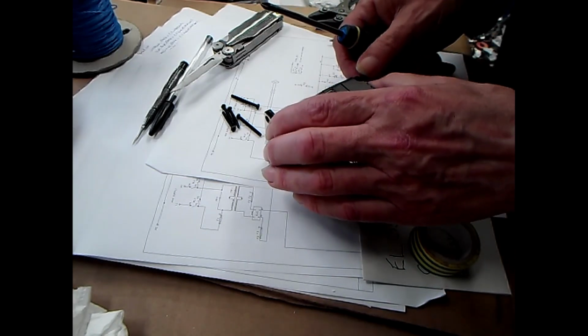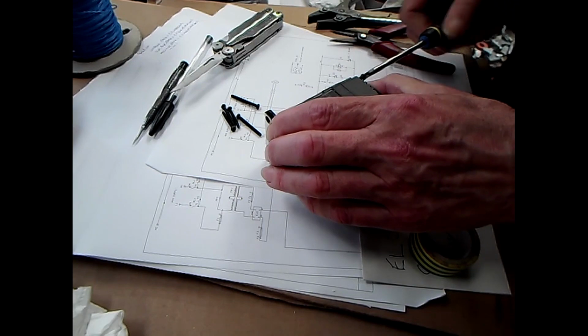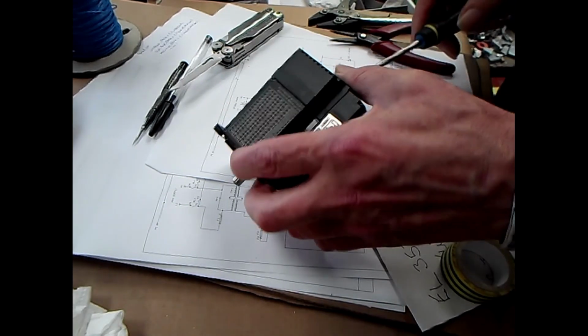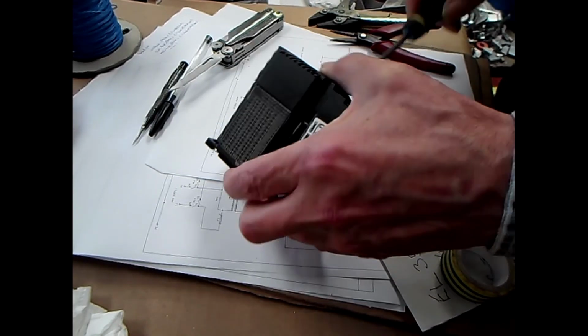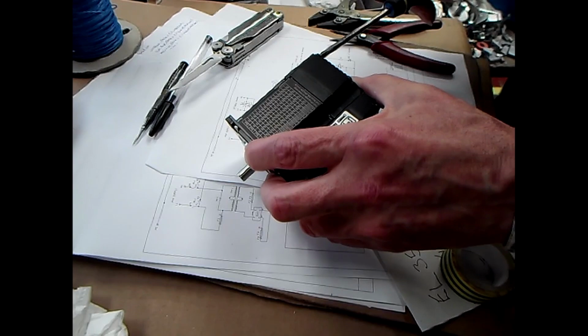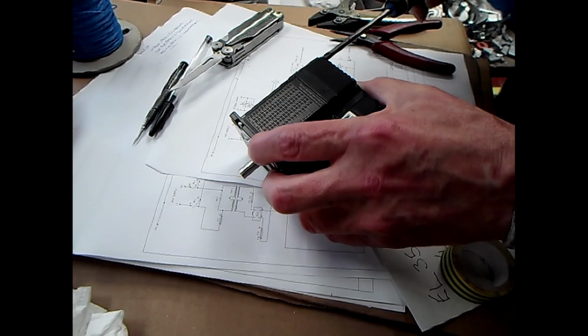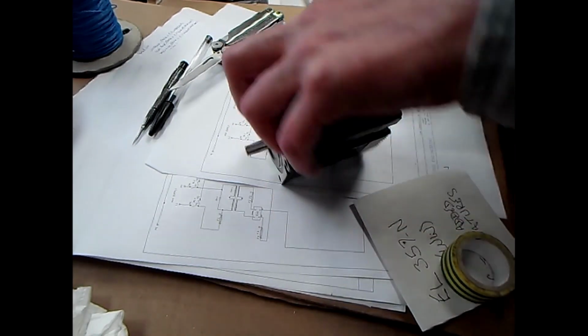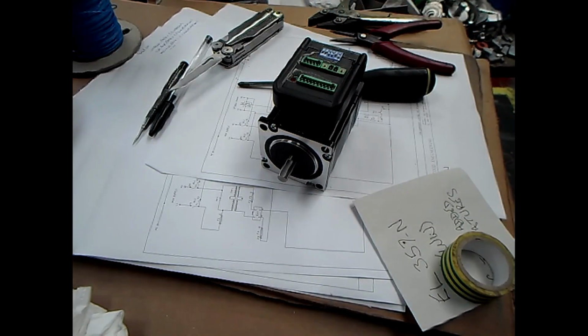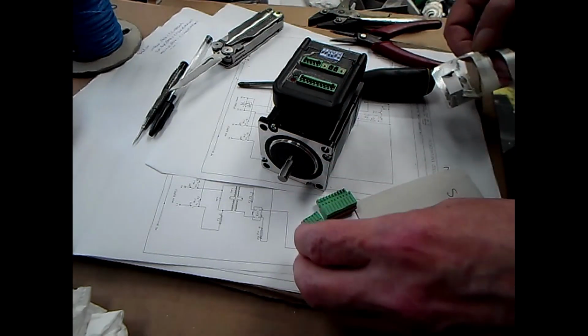If they are intact and the RAM seems okay, the main program can resume. But if the RAM is not okay and there has been a voltage drop on the chip, if the values that have been previously set in these RAM locations are still there and valid, it can be assumed that the RAM has survived and it would be safe to return to the main program.